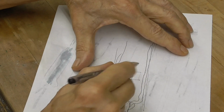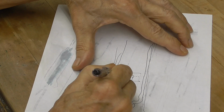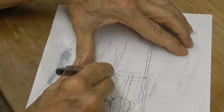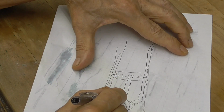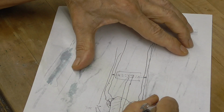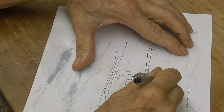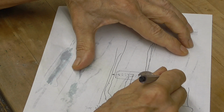Now, on one side, the cathode will be in the center of this, and that'll come out and weld onto here, and then the other end of it will weld to the other one. Okay, that'll give us our two connections for the filament. Now these will be isolated from the RF output. If we look at this from the side, the seal will look like so, and we'll have our two coming up here. Okay, and then that'll be our side view of our plates.